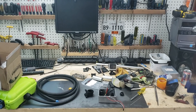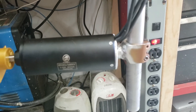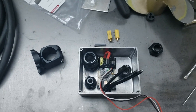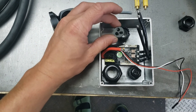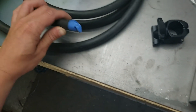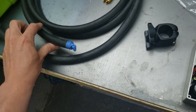Day 2 here putting this electric outboard together. Got some good progress yesterday — a little motor mount has been made in aluminum. It's not the prettiest work but I think it should hopefully be strong enough. We've got our electronics box — a series of glands: a triple gland at the back for the motor cables, and a large gland for the battery cable. This is a 4-conductor 10 gauge cable — I've got the conductors doubled up, so there's kind of two positives and two negatives.